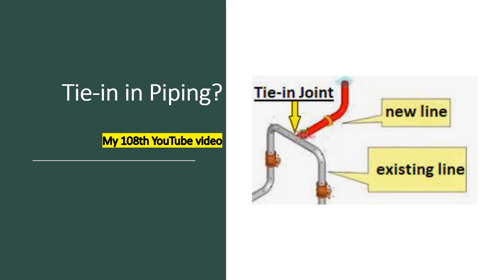For that you need to do a tie-in, which is a very important job. You need to consider many things: the elevation, the tie-in material requirements, the tie-in joint design — everything needs to be reviewed and approved by engineering. Sometimes inside the plant, if you have multiple products and need to exchange product from one part of the plant to another — which was not done at the beginning but was advised at a later stage — then you have to do a tie-in.